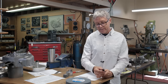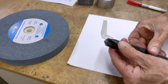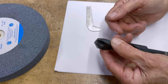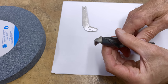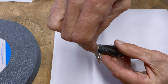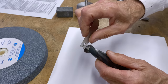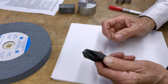When you're sharpening, you want to keep this at the right angle. When you flip the drill over you want that to be at the same angle. Some people use a rest — I do it more or less freehand. Whichever way you do it, you need to be able to move it. You can put one angle on, then a different angle, then maybe even a third angle. I don't think that's really necessary — as long as you lift up the drill and get that rake, that's what's important.